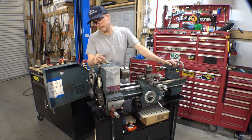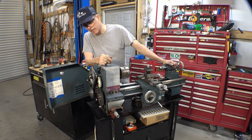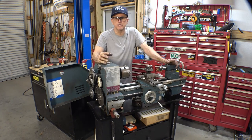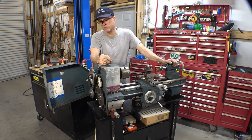All right, the 3D printed gear does work. It needs a little modification to fit into this machine. It's a little bit too thick and it's a little tight around the center. The tight around the center part might have been because my 3D printer might over extrude a tiny bit. So settings are important on 3D printers.